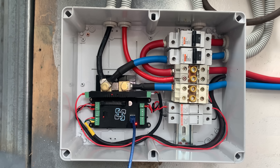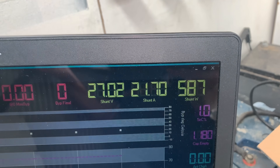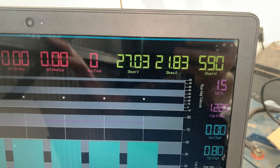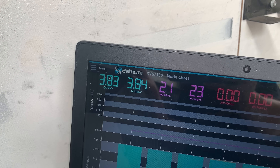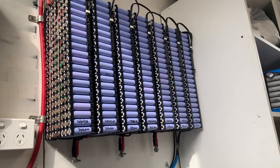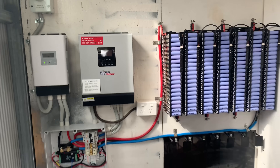The shunt's beeping away, the Watchmon is beeping away, all the cables are there. We're charging at about 21 amps by the look of it — shunt shows 27 volts — almost 600 watts. The battery voltage is pretty close, that's about as close as it gets. I did bump charge the second cell up there — it was just rather low, the second from the right. So there is something wrong with one of those batteries. I'll have to investigate it, but they haven't been cycled so I'm not too concerned. They are secondhand batteries, so we've always been going to have problems.